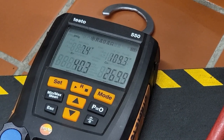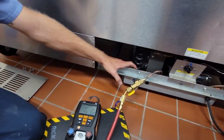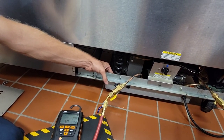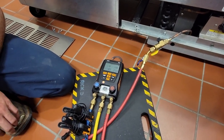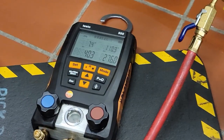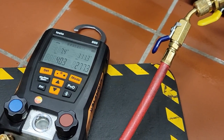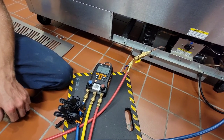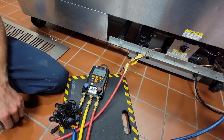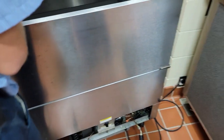It's running right now at seven degree evaporator temperature. Head pressure looks a little hot but we're also dealing with a warm box which drives everything up. The top of the coil is a lot warmer than the bottom - that's good, it means you're condensing at the bottom, coming out liquid, going in as hot gas. I don't like the head pressure being up there, but we just started it and the box is also at 65 degrees. We're probably at about 40 degrees over ambient. We went over by half an ounce to an ounce - when we disconnect we'll just keep what's in the hoses out of it. Just shut off. The walls are starting to frost - that's good, so it's feeding really well.